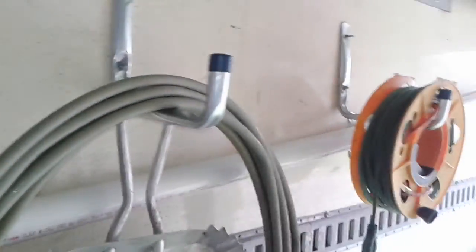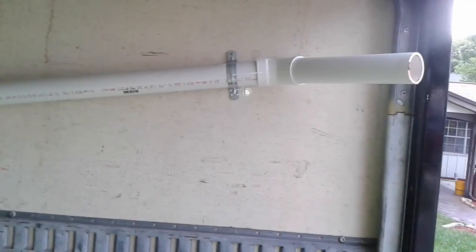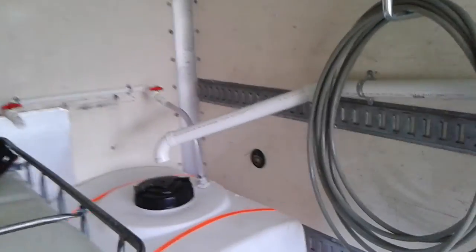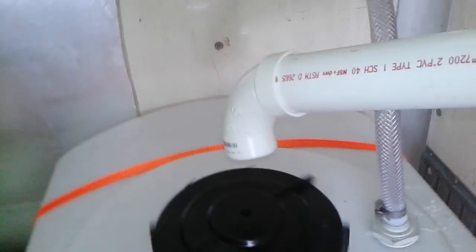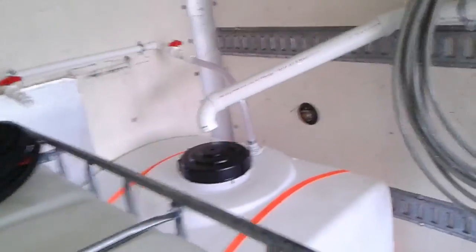When we go to fill up our chemicals for roof cleaning, we have a pretty nifty contraption. We get our sodium hypochlorite fresh — when we pull up to the plant where we get our chemicals, instead of storing it in our shop for a month or two where it starts to lose its strength, we get it fresh for every job. We come plug a hose right in here, turn the ball valve, and this is gravity-fed — gravity pulls all the chemical right down into this tank. I never have to worry about a caustic chemical hose dripping on my equipment and screwing things up.